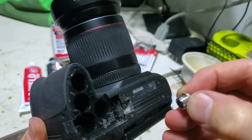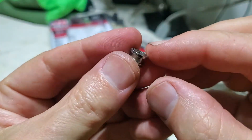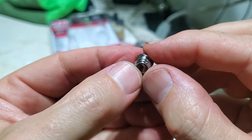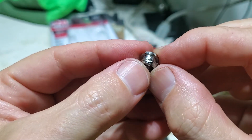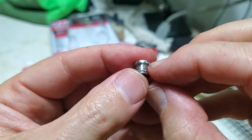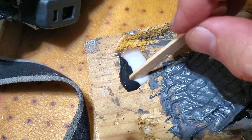I also want to mention that I took this metal insert part and roughened it up a little bit, making some notches so that later when the epoxy holds it will have something to grab onto. I also roughened all the surrounding plastic pieces. Okay, so let's get to work.